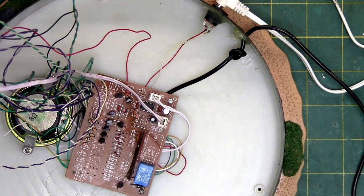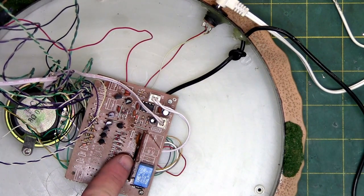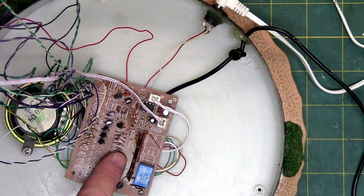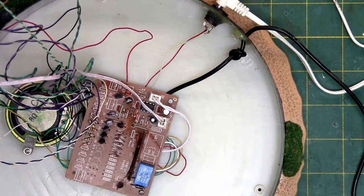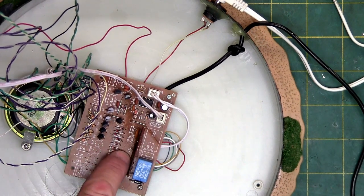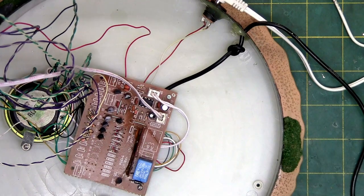After diagnosing this for a while, I'm determined that this blob chip probably got smoked — meaning it shorted out or the wrong power supply was plugged in, which is very common. You have a five-millimeter barrel plug, you grab a 12-volt AC adapter, and if you're lucky, you just burn out the incoming power, one of the smoothing capacitors or one of the resistors. But if the power goes through quickly enough, your blob chip is what gets sacrificed. Once you lose your blob chip, that controls everything. That's why it's called an integrated circuit.